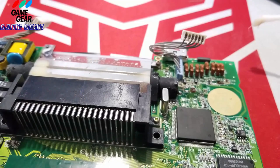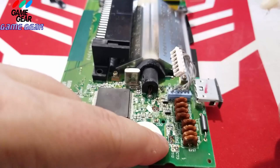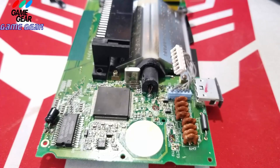All right, which way is the positive? Well, positive is sitting on... So you see the positive sitting right there, guys. Above my nail, you see that? Right there. So we're going to go ahead and already wiped it down, already cleaned it. We're going to add a drip of solder on each little contact there from fresh solder. So you could just nail them down like I just did.